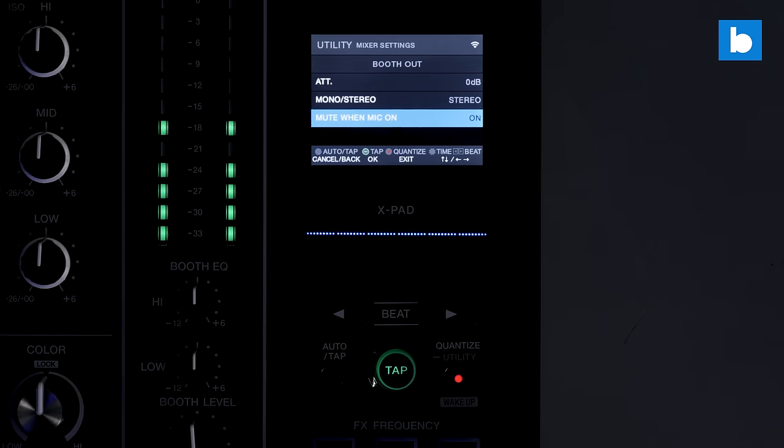Staying with connectivity, there's literally nothing to argue with here. Each of the four channels has separate RCA inputs for phono and line as well as an RCA digital input, switchable between those three plus Bluetooth, computer A and B, effects return, and USB return on a per-channel basis — very flexible. The outputs comprise Master 1 on XLRs, Master 2 on RCAs, a record output on RCAs, and a digital master output too. I'm a little disappointed the A9 doesn't feature an AES/EBU digital output as found on the DJM Tour 1, but I appreciate that would have taken up space. The booth output is on balanced jacks with high and low EQ controls next to the volume pot, allowing DJs to tune what they hear in the booth without affecting the main output. The send and return loop is on unbalanced quarter-inch jacks, and there are two mic inputs: Mic 1 on a combo XLR and jack socket with phantom power, and Mic 2 on a balanced jack.